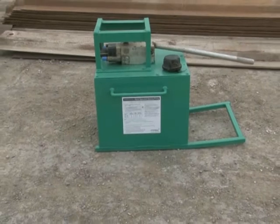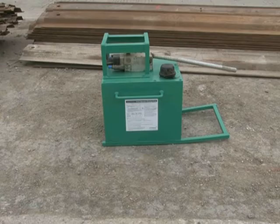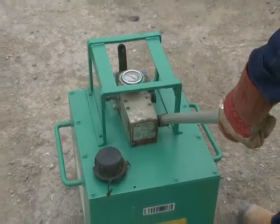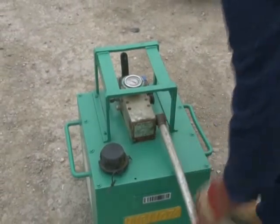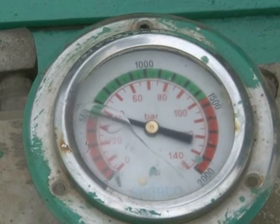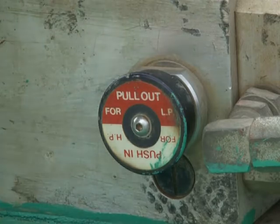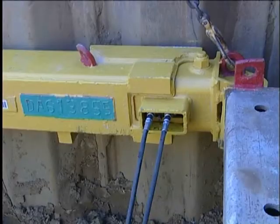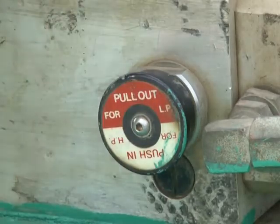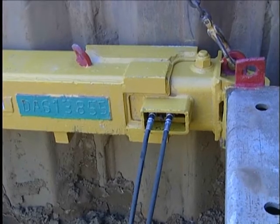The mega hand pump is designed for double acting equipment. The pump comprises the following components: a 40 litre capacity fluid tank, the pump body and operating handle, the flow direction valve, the pressure gauge, and the fluid pressure delivery mode button. This button is pulled out for high fluid volume at low pressure — that is when the leg is being initially pumped out — and pushed in to deliver low fluid volume at high pressure for final pressurization of the leg.